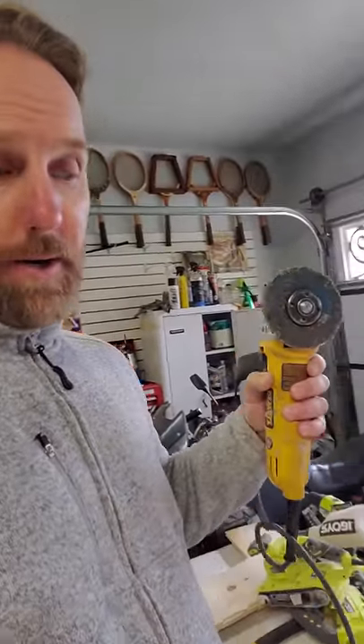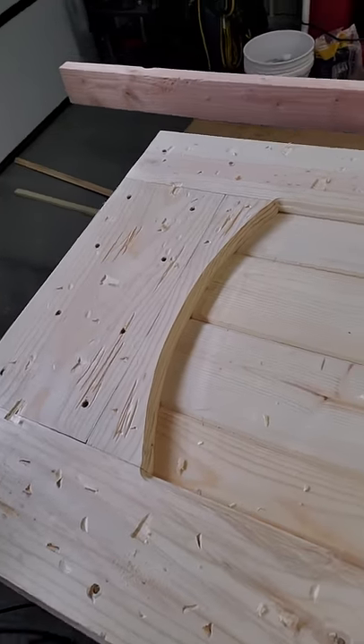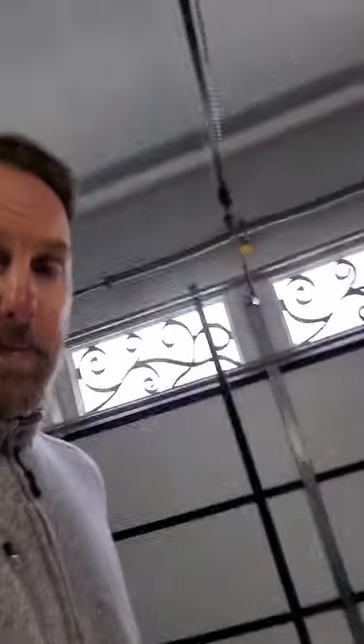Now I'm taking my angle grinder. You want to kind of work with the grain to make it look like there's some kind of natural issue with the wood. I've already started here — just put a couple of grinds in with the angle of the wood. You don't want to go cross-grain; cross-grain gives it an unnatural look. Going with the grain when using the angle grinder actually gives it a really authentic look. Let me go ahead and demonstrate.